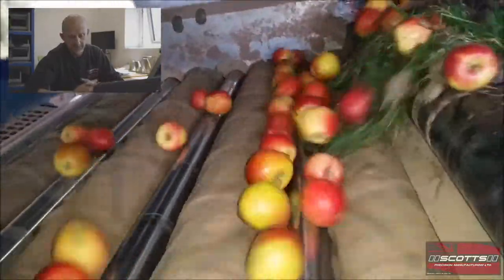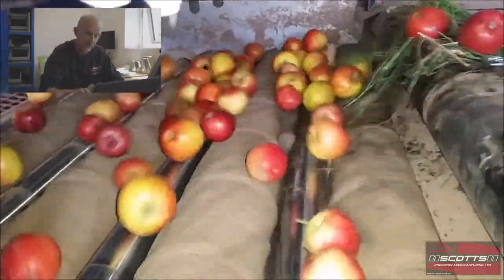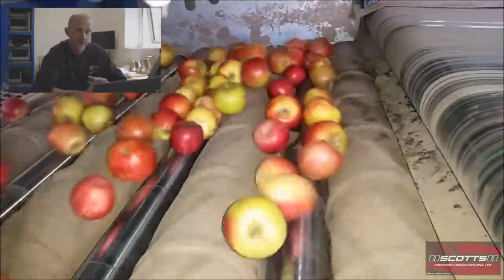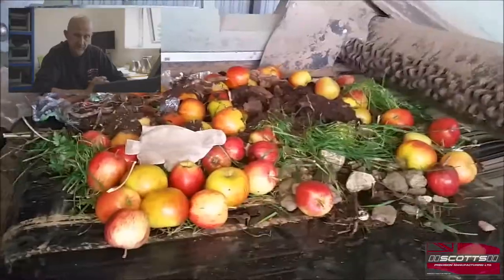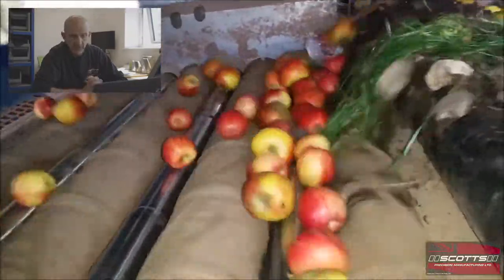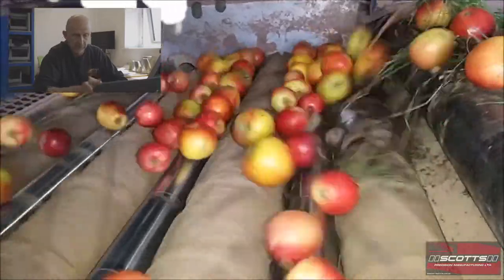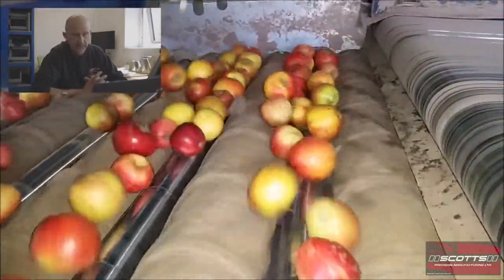As I say, it's very difficult to do a bad job — they really do extract really well. Running this video through, you can see it's very, very efficient for taking out the weed and the haulm and the grasses. Stones and clods take a little bit longer, and if not grabbed in the first valley, will move down to the next valley in the subsequent ones.